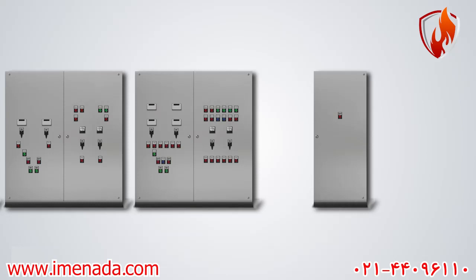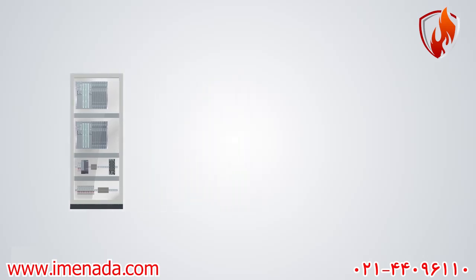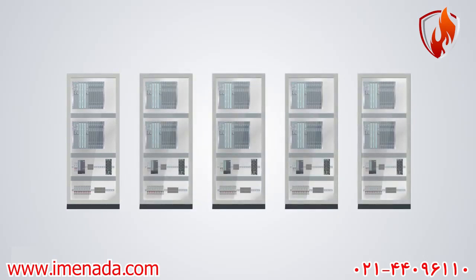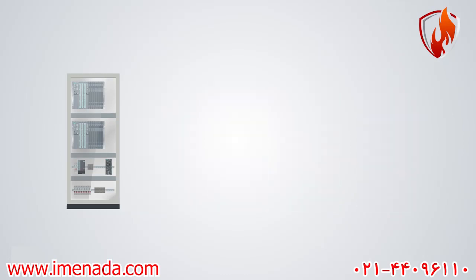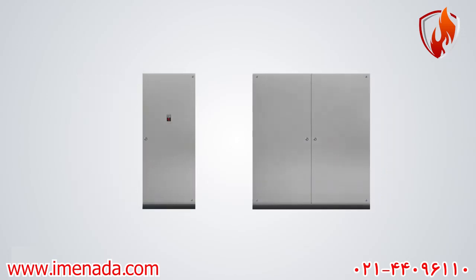The number and the size of the panels may strongly vary depending on the type and scale of the control system. For example, if the control system is DCS, then we might need up to 4, 5, or more separate control panels. If the control system is PLC-based, then one single door or a double door panel could be enough.